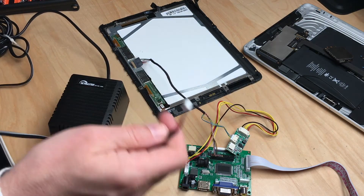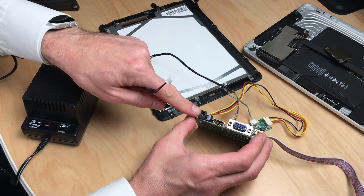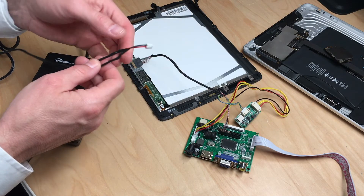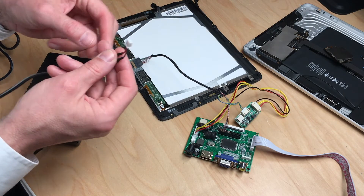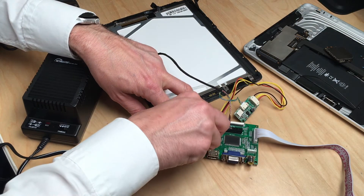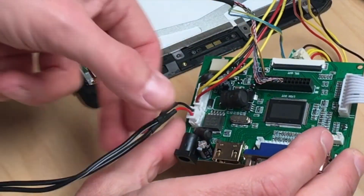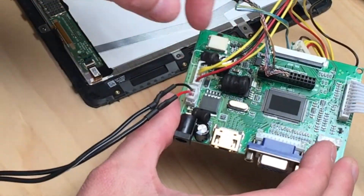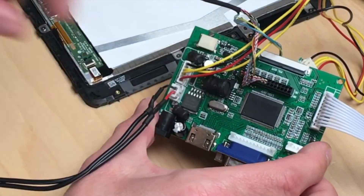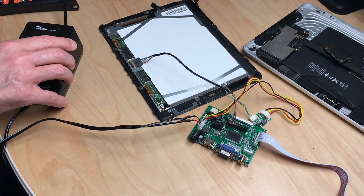On the other end — because I didn't want to destroy this port and the connector was already cut off — I just soldered a small connector on here, and this fits perfectly on the middle two connectors on this board, providing it with 12 volts. Don't be put off by the cable color — it's wrong: it should be red for positive and black for ground, but it's reversed.